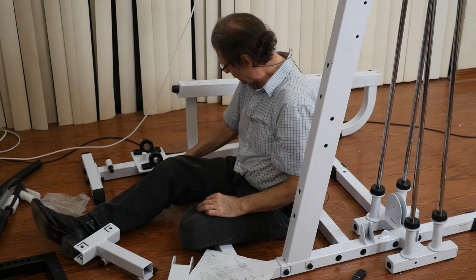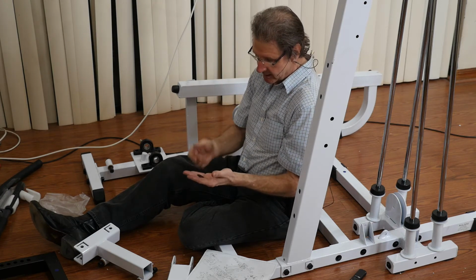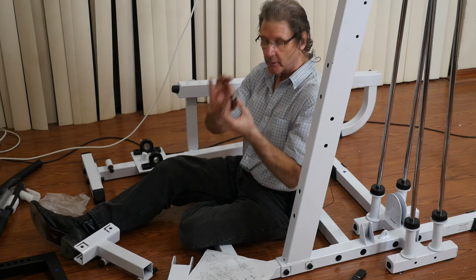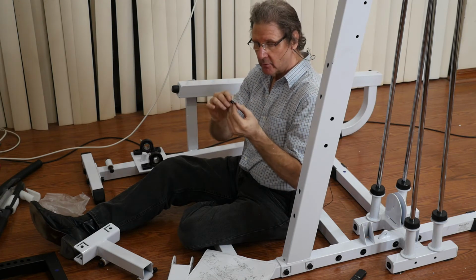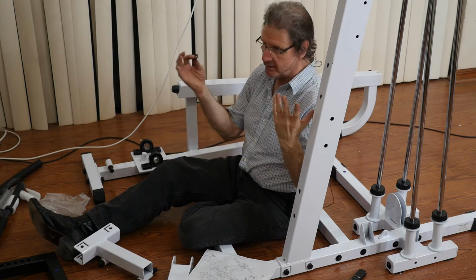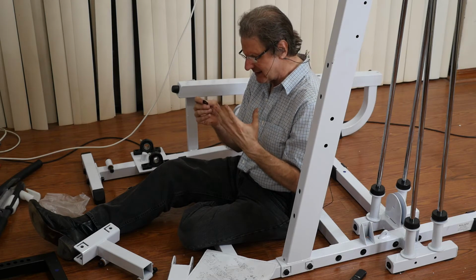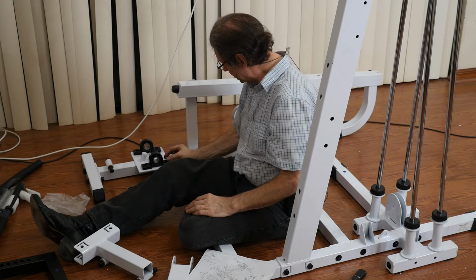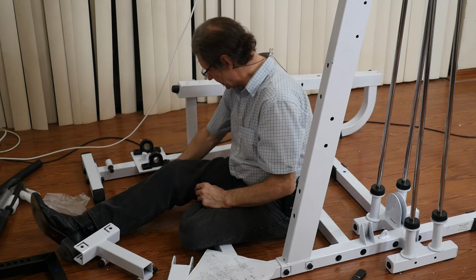This is where three washers, those ones with the smaller outside diameter, I'll take a picture and show you that they're like AN style, Army Navy style washers, where the outside diameter is much smaller than an SAE, Society of Automotive Engineers washer. And that was intended, it's another mystery. It's not clear the way they call it out, ID, OD, it's not simple. But there's four of them, and it matches the bill of material, and it would make sense that that's what they want spanning over this pillow block to get the motion that they need.